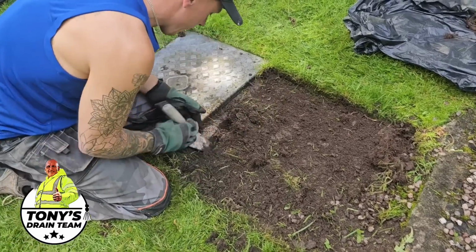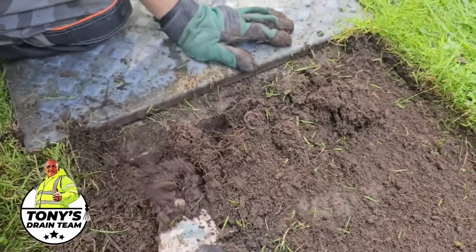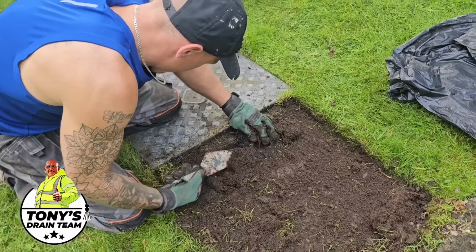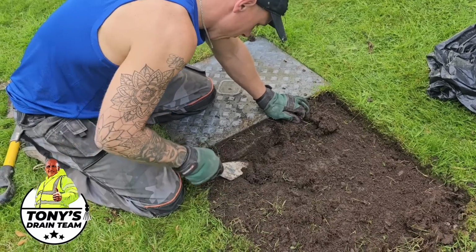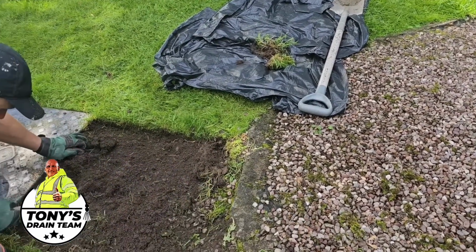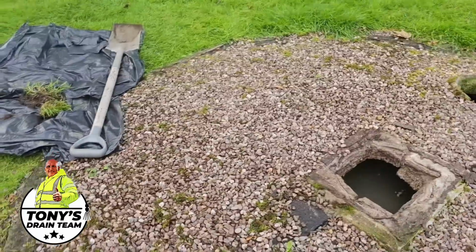Anyway, there's the blue one. Yeah, so that is the discharge pipe going off to the soakaway, wherever that is. It's not the right pipe to be using to discharge, because you could mix that up with a water main. It's very shallow, isn't it? Literally 2 or 3 inches below the surface. Anyway, we're going to dig down a couple of foot, put our new pipe from the edge of the septic tank into the cess pit, and we've then bypassed that little pipe that was being used to discharge the overflow from this tank.